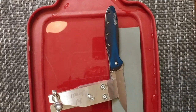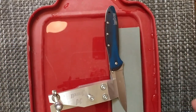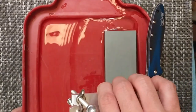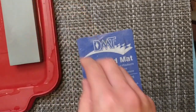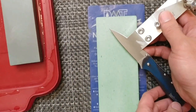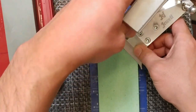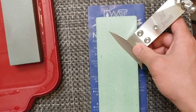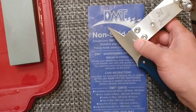There are two different rod lengths — 110 millimeters and 140 millimeters — for taller or shorter stones. For example, this setup was 17.5 degrees with the taller stone, but when I switched to the shorter stone Jeff provided, it read 21.55 degrees. So the height of the stone changes the effective angle, and you have to account for that.